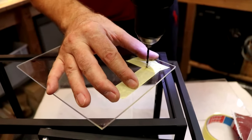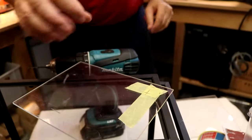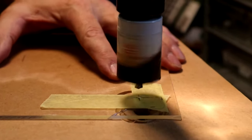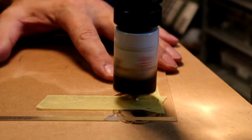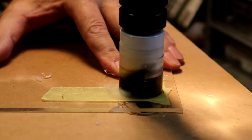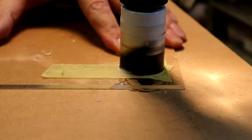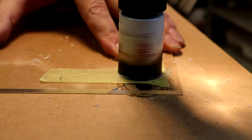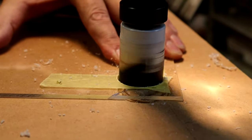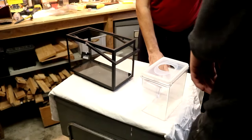This is the finished result of all the plexiglass cuts. We measured where the outworlds were going to connect with the plexiglass using tape and measuring. We were then ready to do the big holes for the plexiglass - once again starting with a small drill then going to the large drill to make a precise big hole. This is really where you need the drill press, because a handheld drill will vibrate and risk breaking the plexiglass, forcing you to restart. You can't really do this DIY without this machine if you're using glass or plexiglass.